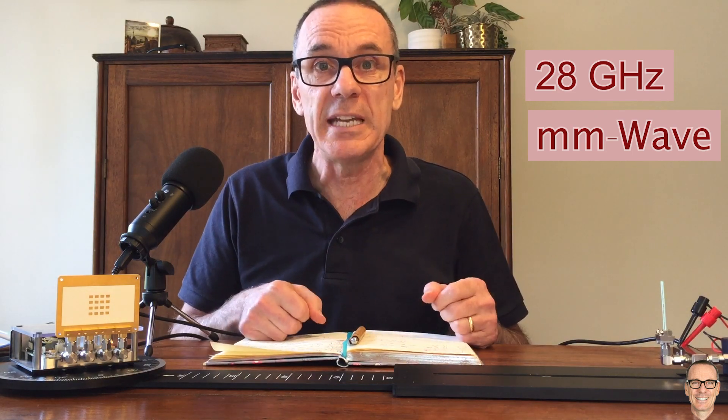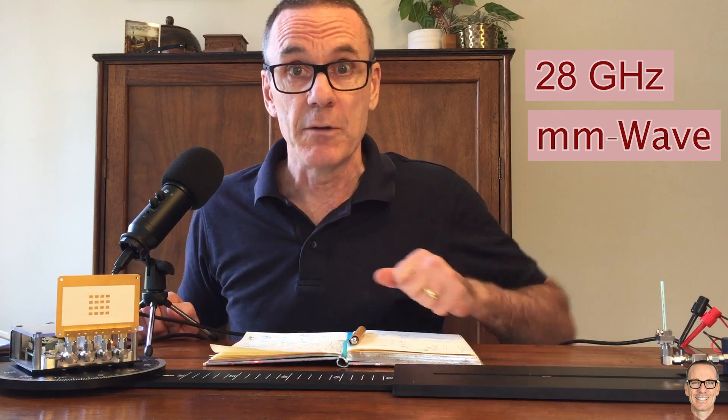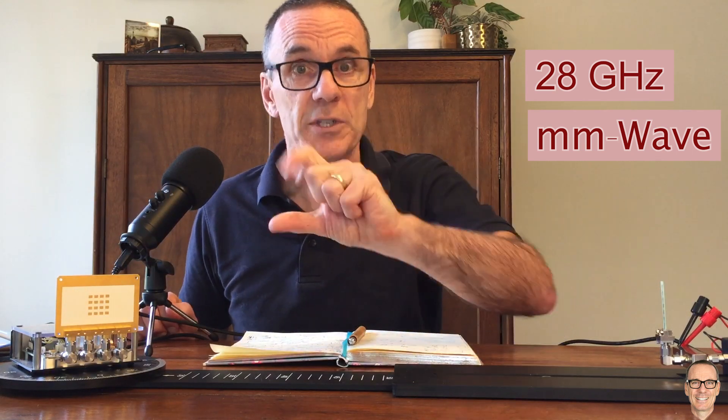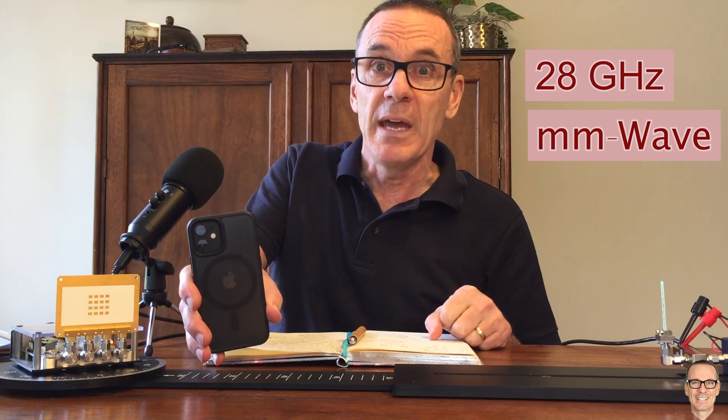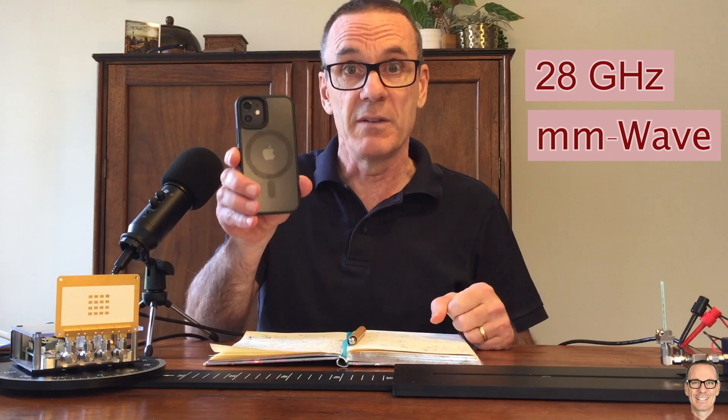Here we've got equipment from TMYtech, and it's an excellent setup for testing beamforming at millimeter wave. You can see the array here has 16 radiating elements, but in fact there are only four channels. We're going to be beamforming in the horizontal direction. Each of the vertical columns are all connected, each to a different channel. This is a form factor which would be reasonable for a mobile phone in 6G mobile communications. It's unlikely that you're going to get more elements onto the back of a mobile phone than we're seeing here. The wavelength at 28 gigahertz is one centimeter,